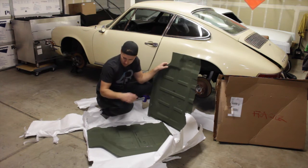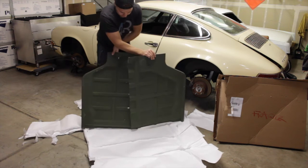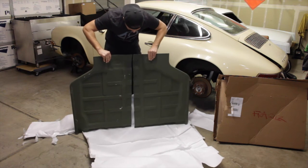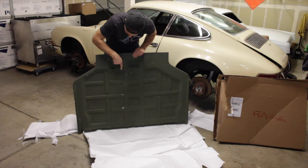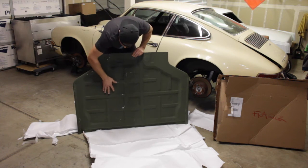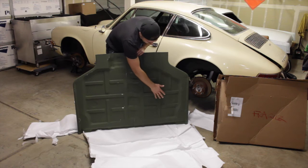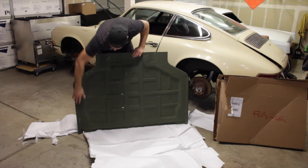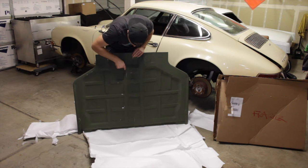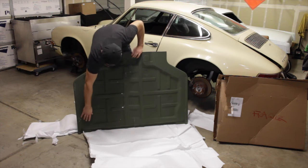Great packaging — that took a while to open up. What I'm going to end up doing: my rust is pretty much centered on both sides, kind of around the floorboards on the lower level, where the water would just kind of sit. So the rest of the sheet metal up here is clean. I might not do a lot of work if I take out the whole entire floor pan — instead I might just run a cut here, do a nice little bead, and cut down over there.